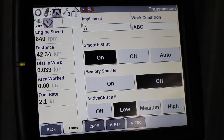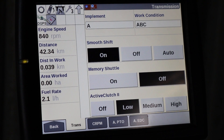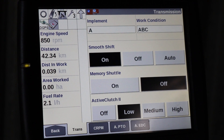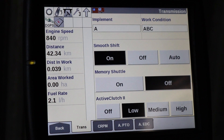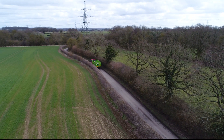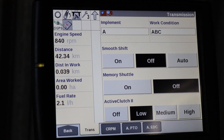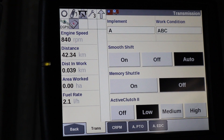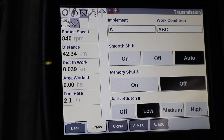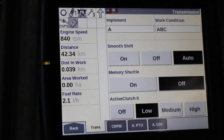With this transmission we have a smooth shift option with three settings: on, off or auto. When we have it on and we change gear — either upshifting or downshifting — the engine RPM will fluctuate to match the gear speeds to get a smoother shift. If we have it on off, when we make a gear change the engine RPM will remain exactly the same, resulting in a slightly more aggressive shift. When we have it on auto it will operate normally, increasing or decreasing engine RPMs when we shift. As soon as we engage the PTO it will go to the off position automatically, meaning we're getting a constant engine speed with no fluctuations as we shift gear.